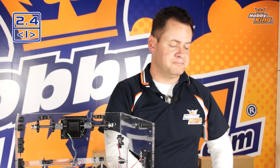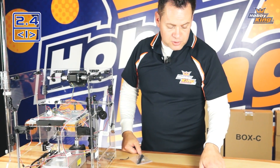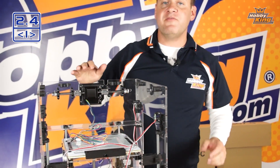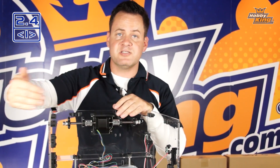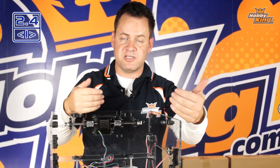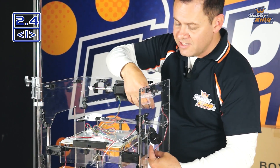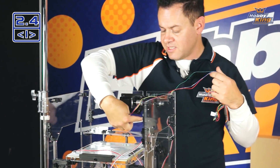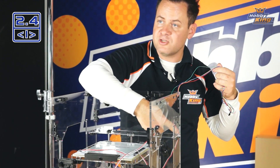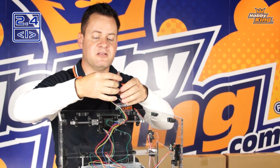Going to the manual, first is the Y-axis stepper motor wires to the back right corner. On CNC machines, Z is always up and down, Y is front to rear, and X is side to side. Our Y-direction sensors are this one and this one. The sensor wire we already ran when we installed the side panel, but now we need to install the stepper motor wire through there. It has a secure point up here and drops down through this corner — which is exactly why I said to keep this panel a little loose.